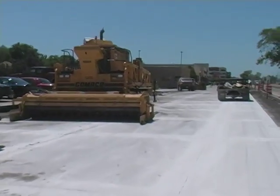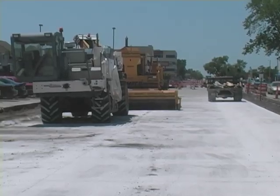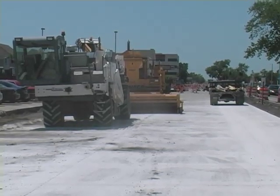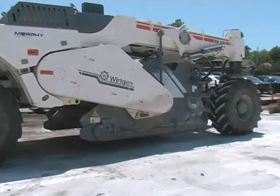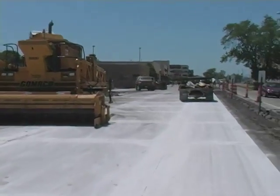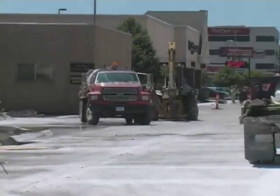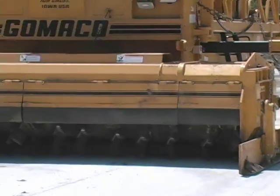After five to seven days, the concrete will have enough strength for us to get equipment on it. We require the concrete to gain around 3,500 pounds per square inch strength, which is plenty for handling most trucks and construction equipment. After five to seven days, we'll be opening up sections and allowing traffic to cross.